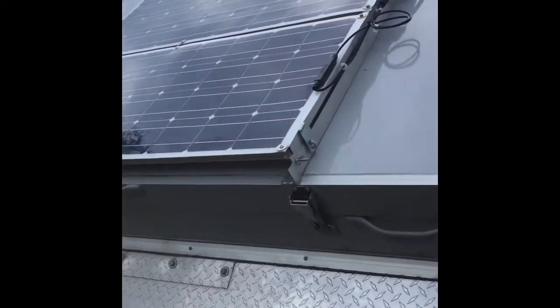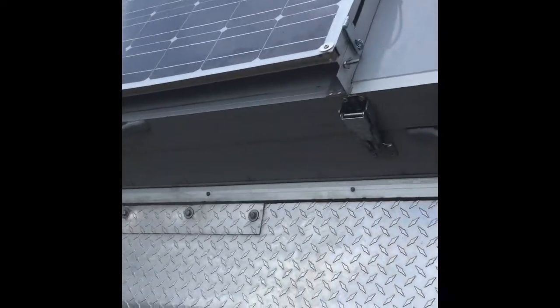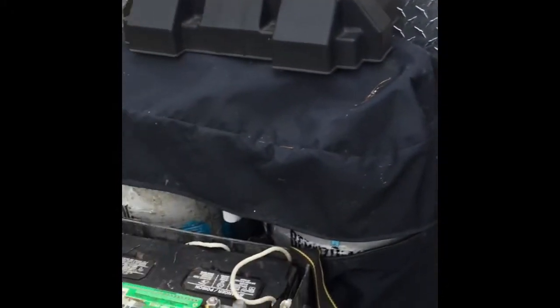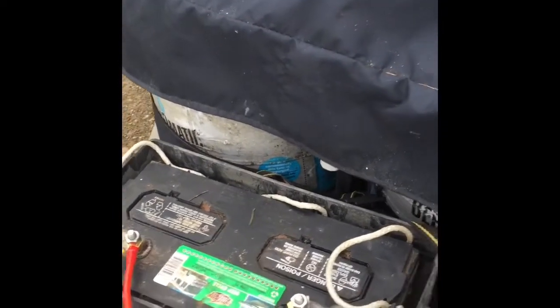So they're rated about, I think, 6 amps and 20 volts. So I'm combining the voltage into 40, and I have a 20 amp charge controller from Renogy, the Commander, which I'll show you here. So I ordered off of powerworks.com these custom cables for all the connections that I wanted to use. So this is the power from the battery, or the leads from the battery.